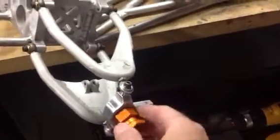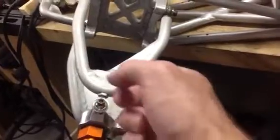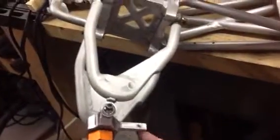When I ended up using those wheels, it turned out that when I turned the wheels, they would rub the suspension arms, so I had to notch those out. I had to gusset here so that the wheels could turn farther, so I'd have a decent amount of steering.